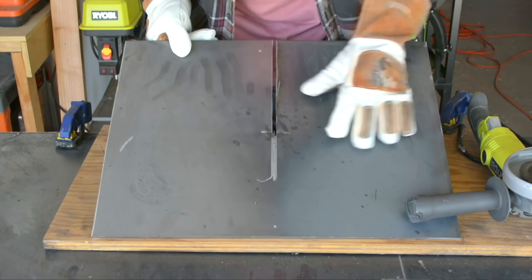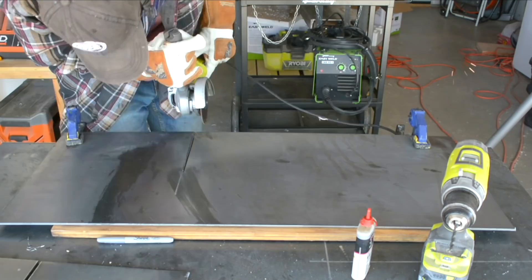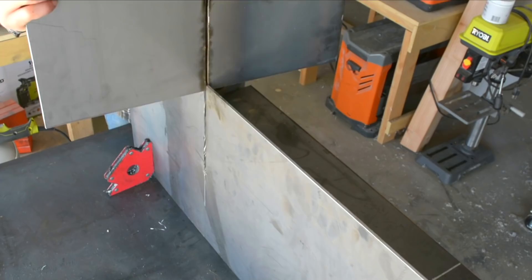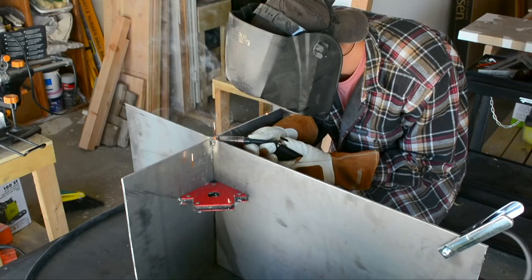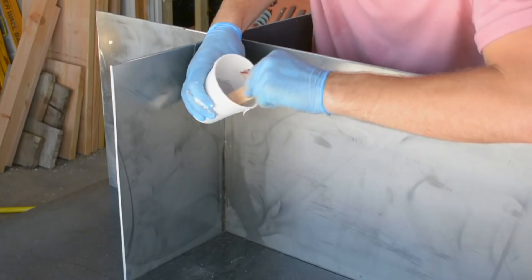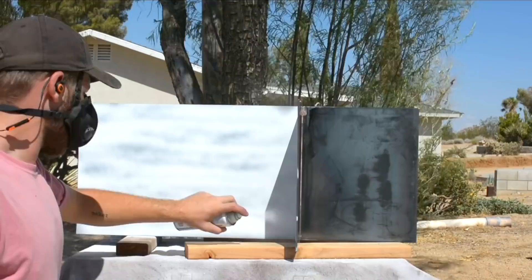I lined up the groove on the long piece on the third mark, which basically makes a cross that's extruded vertically. What's amazing about metalworking is that your joints don't have to be perfect — because welding is additive, it locks everything in place. I used the Forney Easy Weld 140 with flux wire so I didn't have to worry about gas shielding. Because I used this half lap joint, all I had to weld was the top of the inside corners and everything stayed very rigid. After grinding everything down, I used Bondo body filler to fill in the seams so everything was super clean. Then I applied four coats of flat white paint from Rust-Oleum.